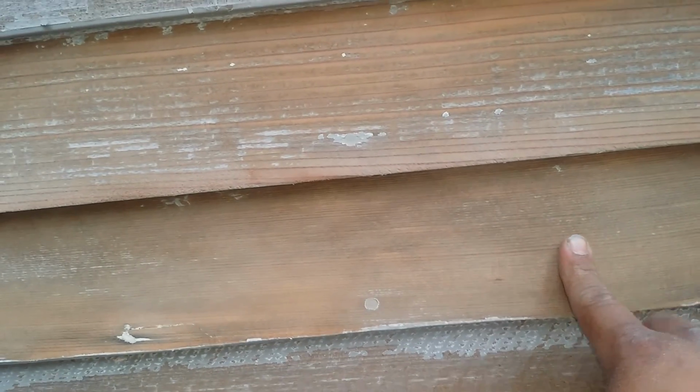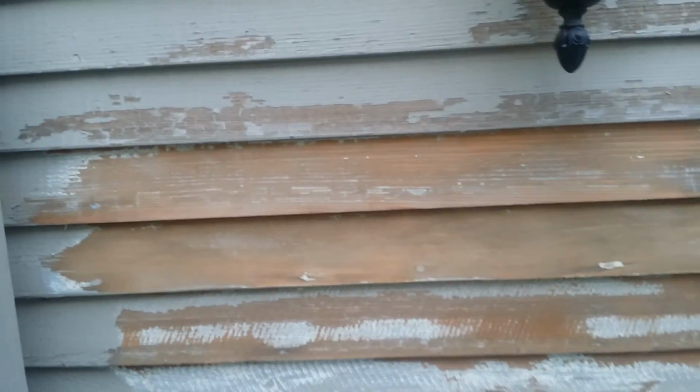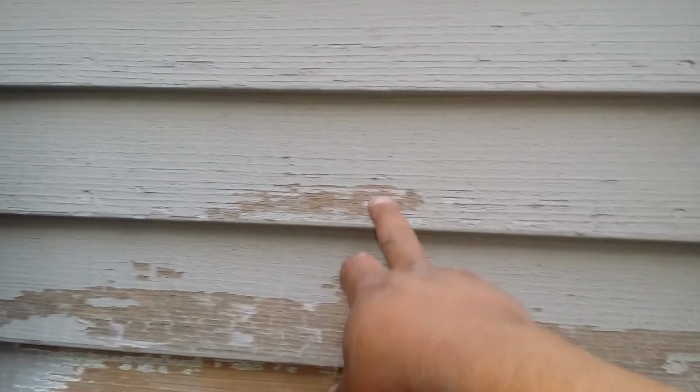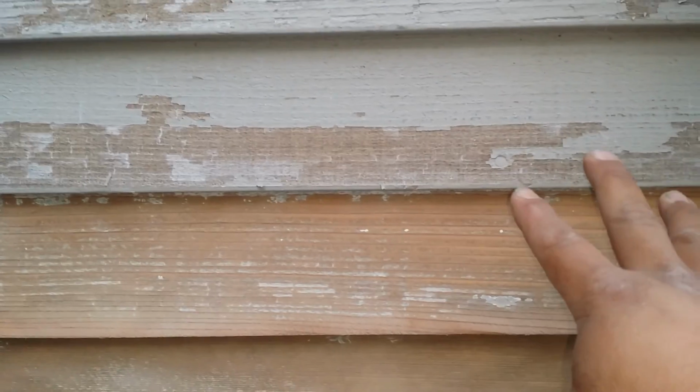That means if it already has the paint peeling here, and we just peel this little area and sand it, it'll just run eventually. So we just take care of it now. That's why we give a 5-year warranty, because we do the stuff right. And I'm not saying every painter does this. There's some painters out there that do some sanding, but I can see we try to take it down.